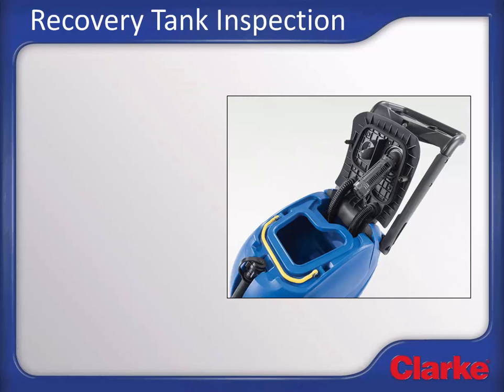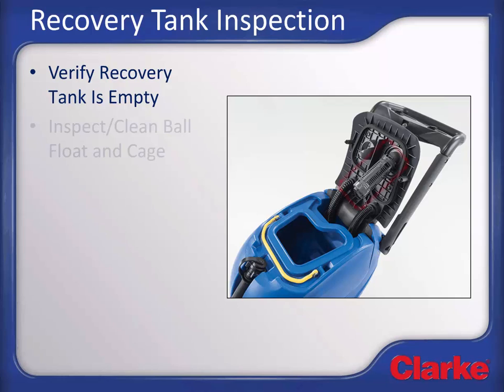Recovery tank inspection. Tip up the domed lid of the recovery tank and make sure that the recovery tank is empty and clean. Check the ball float cage connected to the lid and make sure it is clean and that the ball moves freely within the cage. A clip on each side of the cage holds it in place on the cover and can be opened to remove the ball float cage for a more thorough cleaning.